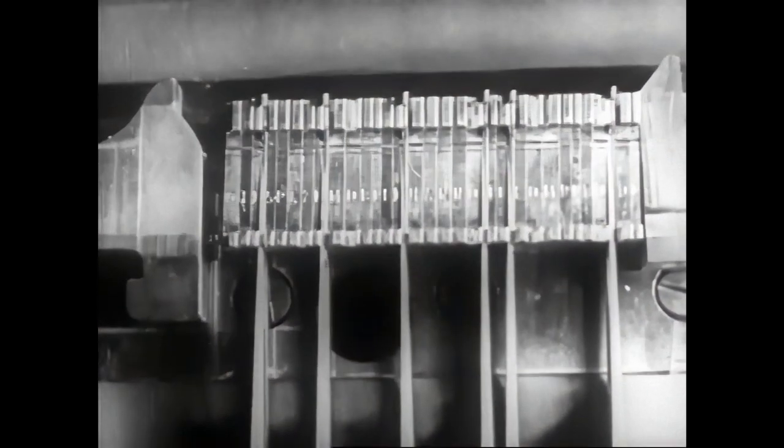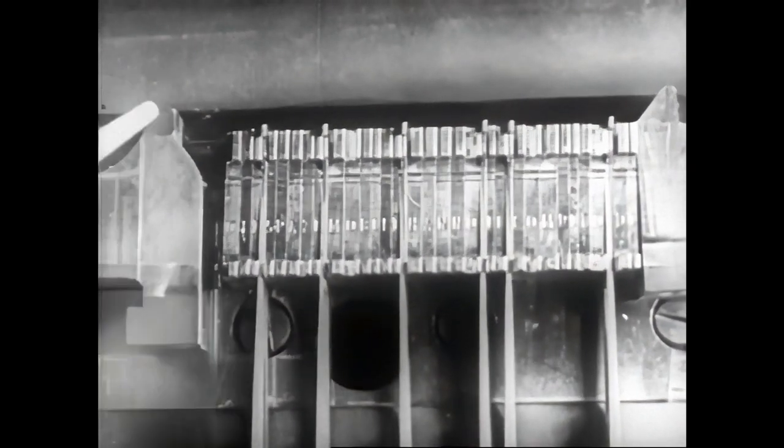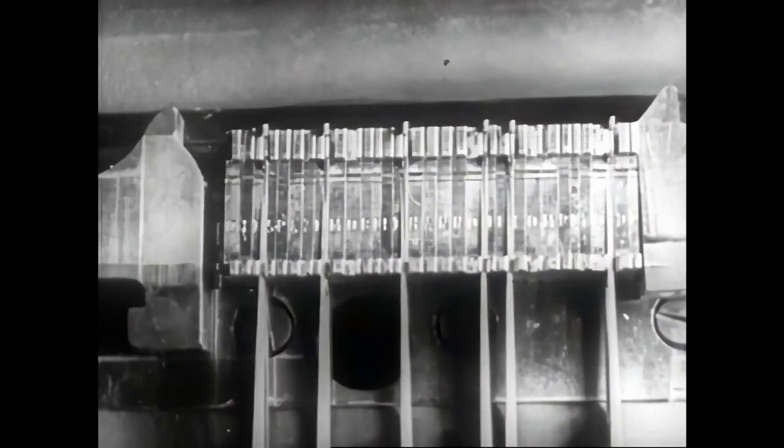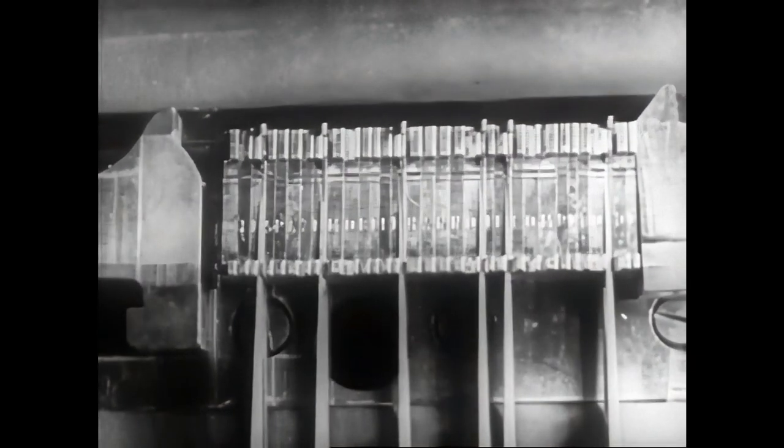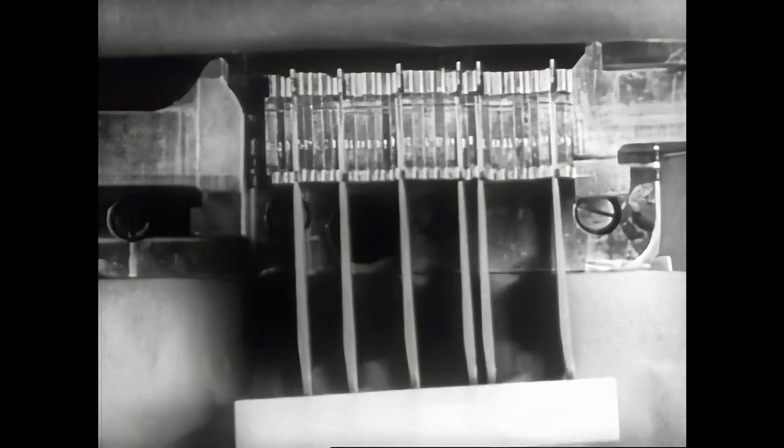Whatever the position of the slide, the outside surfaces of the slide and head are always parallel due to the construction of the parts. The function of the spaceband is to expand or spread out the line to the predetermined length, thereby increasing the space between words evenly. This is called justification.